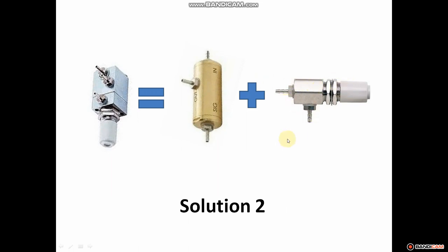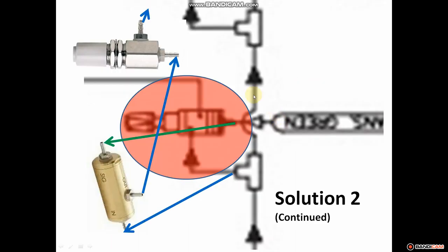Here is exactly how you would apply that alternative approach. You apply your water relay with the water inlet on one side and the signal on the other side. The outlet, instead of going straight to its destination, has a needle valve placed in line. In essence, you regulate on/off at the water relay and regulate flow at the needle valve. The combo valve is all-in-one, but this two-piece approach is a way to solve the problem if you don't happen to have the more complicated combo valve on the truck.